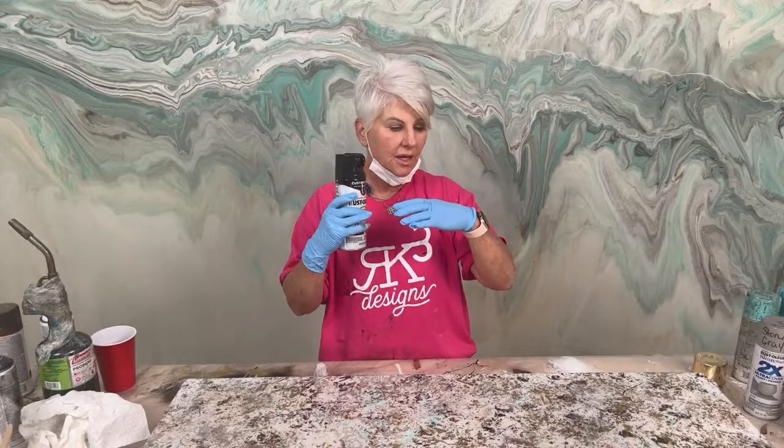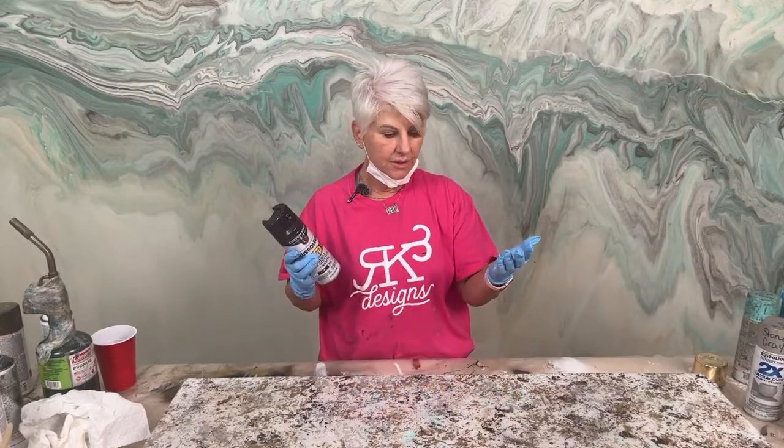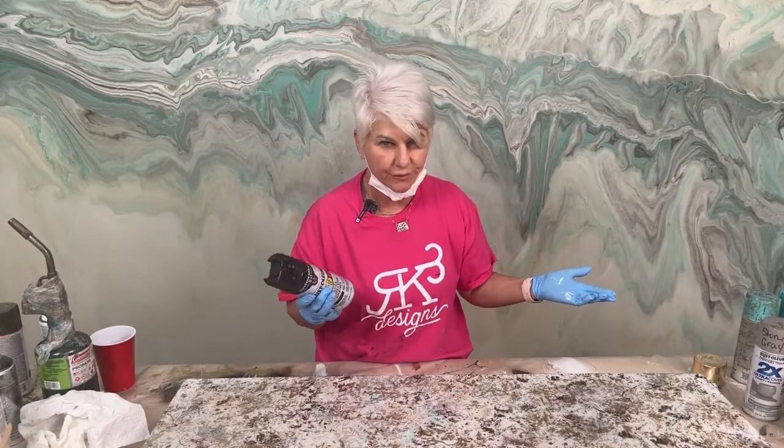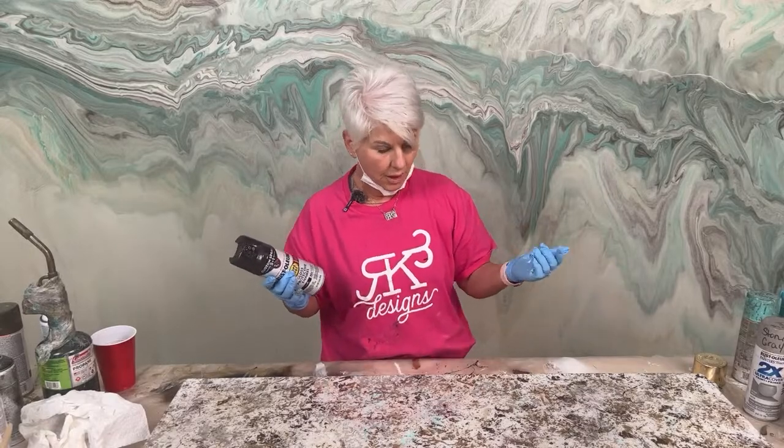Now, I don't recommend using a metallic. Metallics have a tendency to sit on the surface a little more, and because they sit on the surface, they take away from all of your colors that are underneath. I have people use metallics, then they call me and say, I hate it, what do I do? I'm like, well, do a practice board first, make sure you like it before you do it on your actual piece.